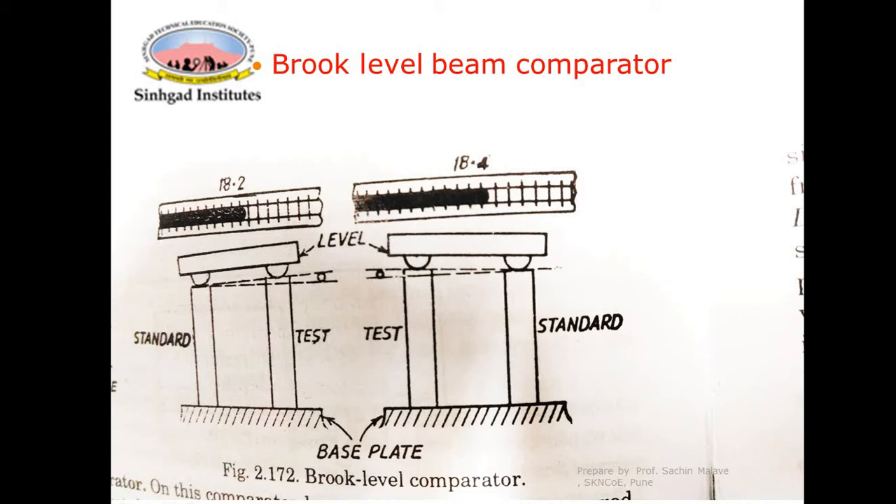This second position is after rotation of the base plate through 180 degrees. This is the level beam. This comparator basically uses a sensitive level tube, which is mounted on a slide allowing it to be raised or lowered and freely take on the correct slope as required by the difference in height. Some balls are included for free movement.